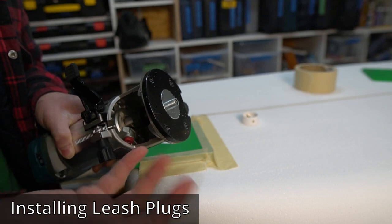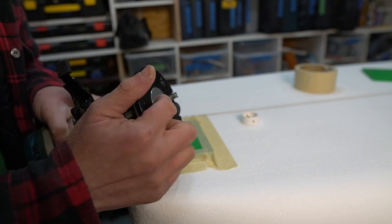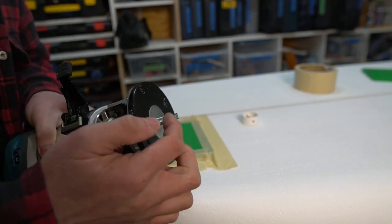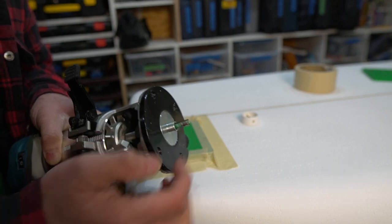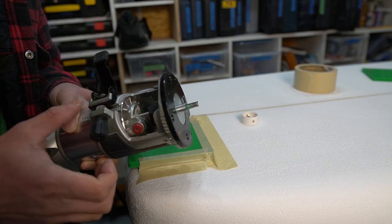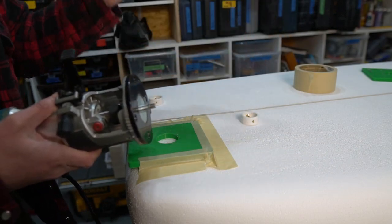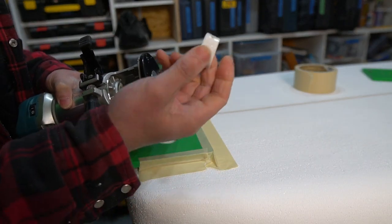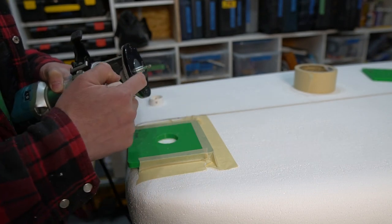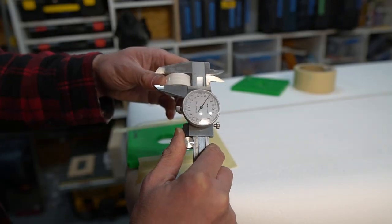How these templates work: I use a bushing kit for my router. The bit rides up and this bushing rides against the inside of the template, and then the router routes it out. I've accounted for the distance between the bit and the outside of the bushing on my templates - it works really well. You could also make these templates out of wood if you don't have access to a 3D printer. I just need to measure the height of my leash plug and account for the template height of nine millimeters - the leash plug height is 14 millimeters.